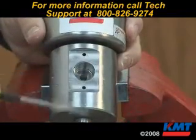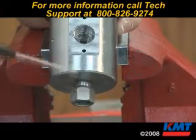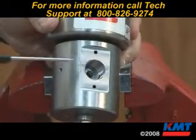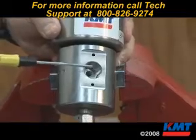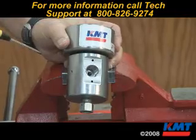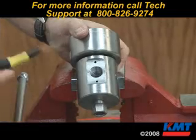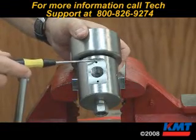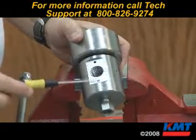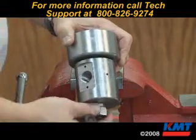The lower weep port means the connection here is not tight enough, or the seat is damaged, or the valve body is damaged. Leakage from this port here indicates that we have a loose gland nut, or the collar on the threads of the tube may be backed off too far where it's not making a good seat in there. It also has weep holes on the other side, which indicate the same thing: your seal, a loose gland nut or adapter, or the threads on the collar may be backed off too far.